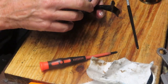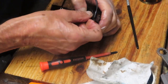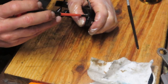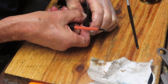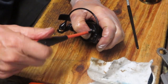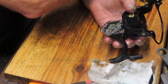As I mentioned, you're not just going to say okay, that was the braid, pull that off and run away from the reel. Reels should be serviced on an annual basis. We saw when we opened this reel up and removed the handle that there was a good amount of salt and debris in the joint of the handle. As we opened up the reel, we saw a lot of ground and dirty grease that's been dried out. So you don't want to take any shortcuts when you're doing this.